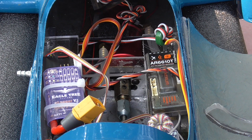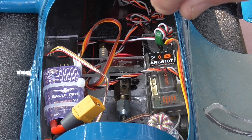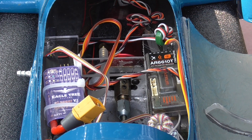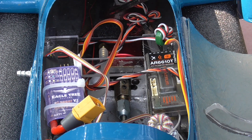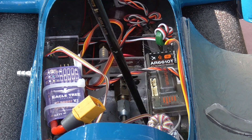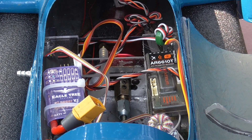What you cannot see is down in the front — there's an OSC Raider 60 amp ESC, and it is water cooled. It's a challenge to put it in there and mount it. So what I did is I made two extension pipes for the water cooling and then was able to clamp these extension pipes to the hull where I could get at them, so I can take the assembly out if I have to.